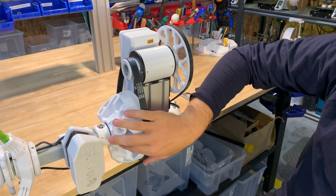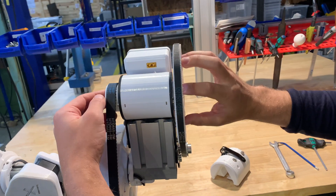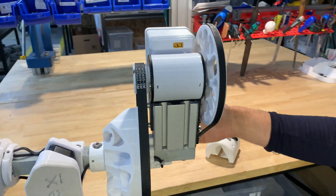We have the low speed side, which is driven by the blades, and we have the high speed side, which is connected through a shaft up here. We call this the top stage, and that drives the generator on the other side.